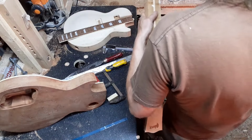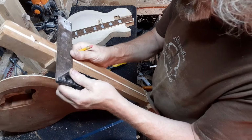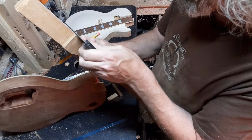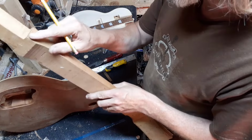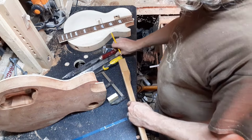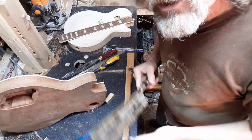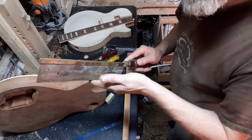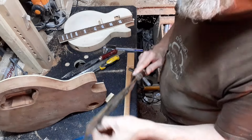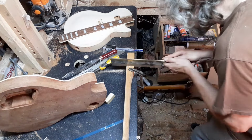One thing I wanted to check: if your shoulders aren't right to start with, and mine aren't quite right, I'm going to start like I've marked, and then we'll get a bit closer, and a bit closer. So right, I'll get back to you when I've sawn this. I'm just using an old fret saw I've got, that's quite nice, but for fret work it tends to cut slightly too wide, so keep it for just a nice solid tenon saw.